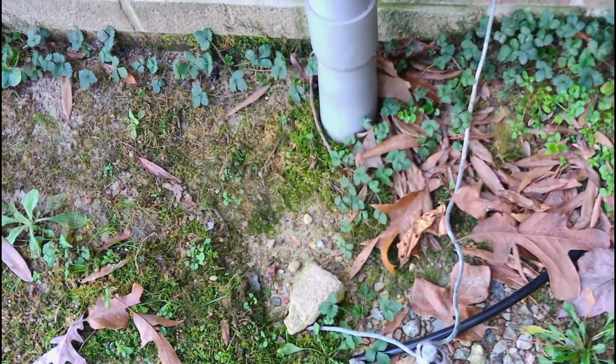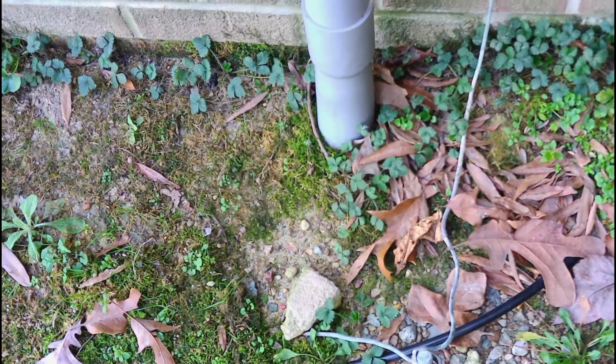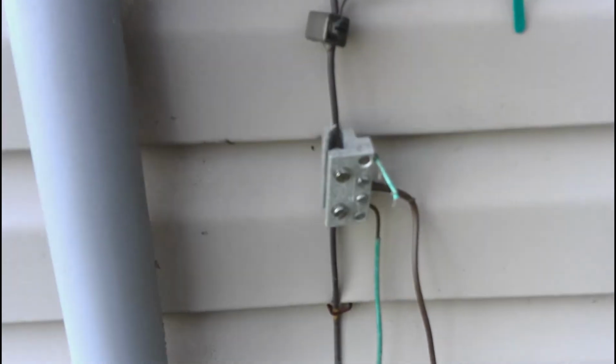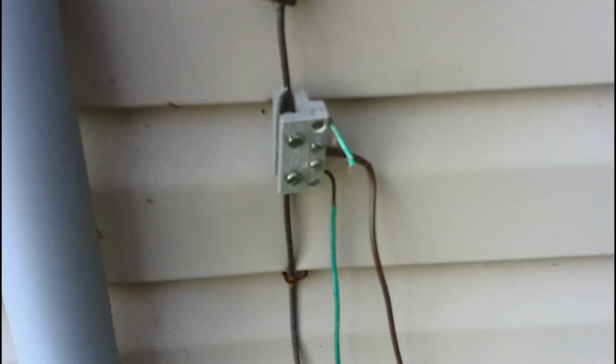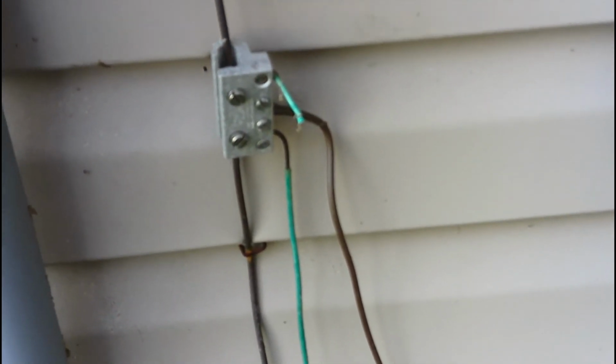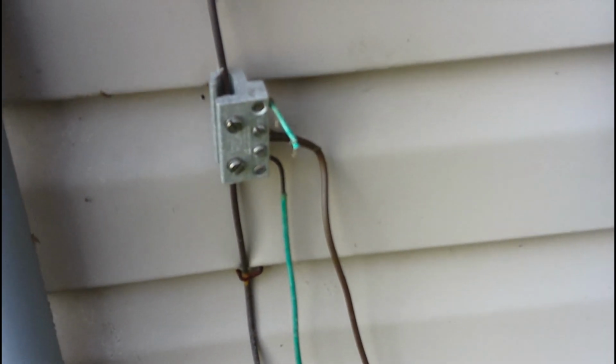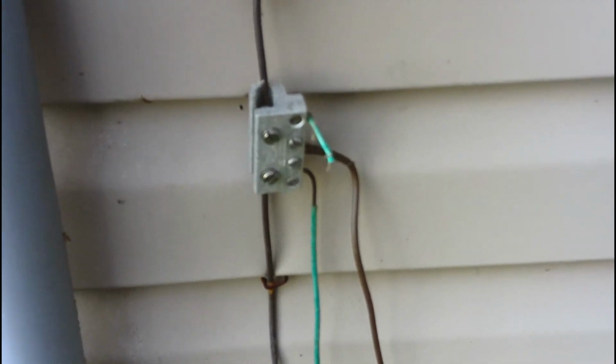to the house electrical ground and its copper rod, according to the National Electrical Code, which is a requirement, and that obviously will prevent surges from differential in ground between the two rods. It's supposed to be 6 feet apart. Well, we're 5.5 feet, but that's close enough.